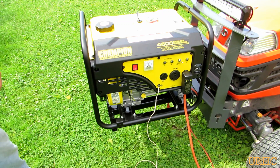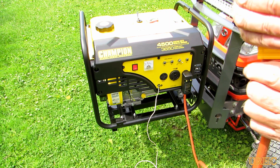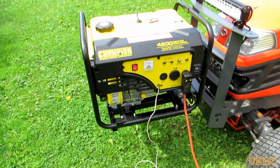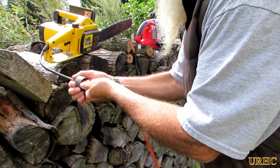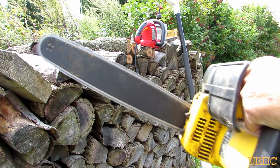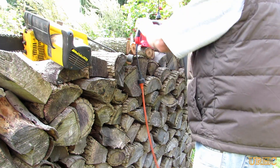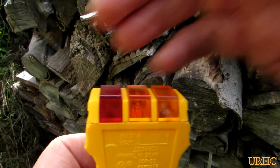I started it up again and put the tester back in. It didn't make a difference — still getting the same fault, and the GFCI still will not trip when the button is pushed. I did decide to try a couple other power tools to make sure they'd work with it and wouldn't trip it. Here's a chainsaw I've had laying around for probably about 40 years — that's a 15-amp chainsaw — and it ran perfectly. Then I grabbed my hedge trimmer that I usually use with the generator and plugged that in, and there was no problem. The GFCI didn't affect it.